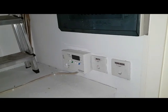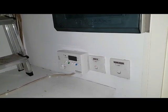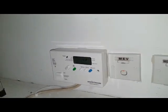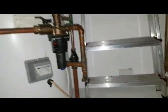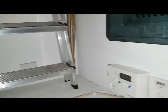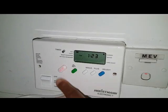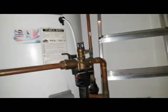We've changed the spur switch and we're now putting in a new Economy 7 timer, as you can see. I've connected up the top immersion heater. Now the customer just has to press the boost button, which is here — you can see it's lit up — and that will give them one hour's hot water.